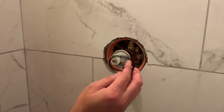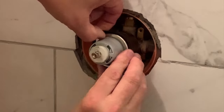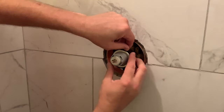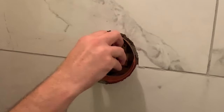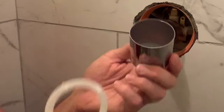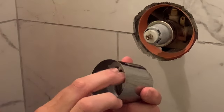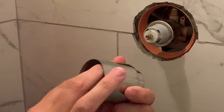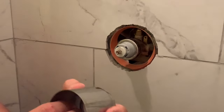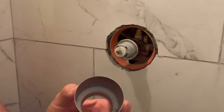So we're going to go ahead and use these to make sure that this is going over the bonnet ring and the valve. It pretties everything up and it'll be nice and sturdy with these pieces on it. First things first, we take this rubber O-ring. We're going to put it over the bonnet here — the bonnet ring — and it slides over that. We'll roll it back to right behind this ring so it's sitting right like that. We'll put this plastic spacer inside here, push it all the way to the bottom. That's where it seats, all the way inside there. And now the rubber O-ring that we already put on is going to go right here, and it's going to seal this real well.